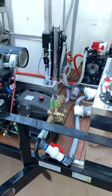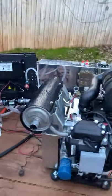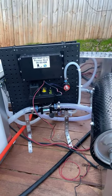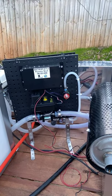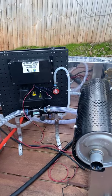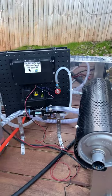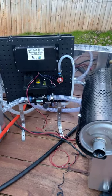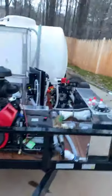I put a cutoff right here just in case he needs to work on it. This is the back side of the manifold right here. There's your box where your remotes are, inside the box your control panel. Got your soap solenoid — stainless steel — that'll go to a soap tank. There's your 12-volt mounted so that turns your bleach off and on. We are going with the uniseals.